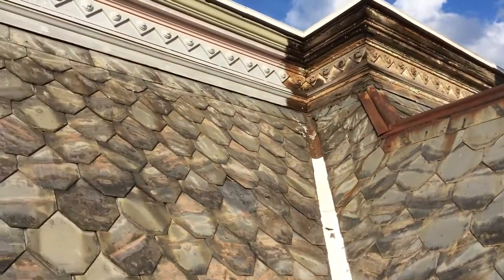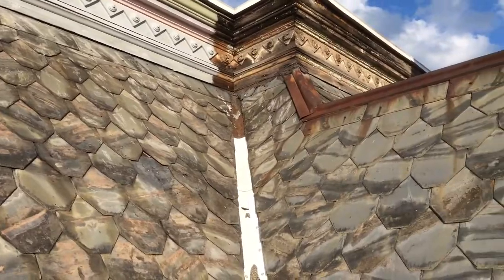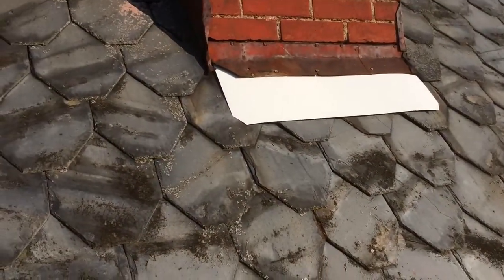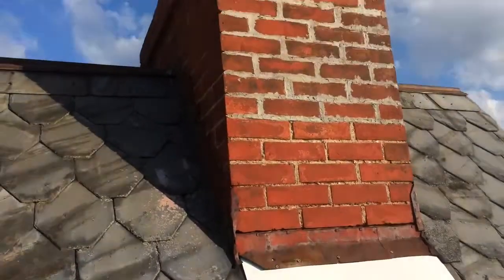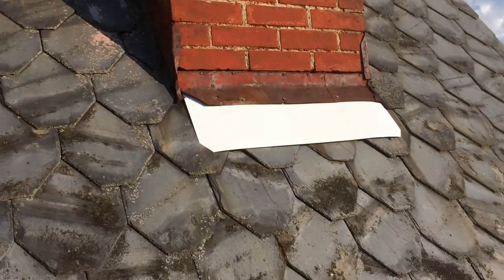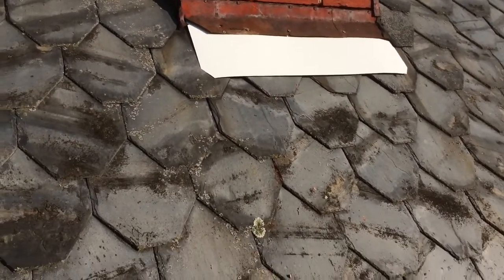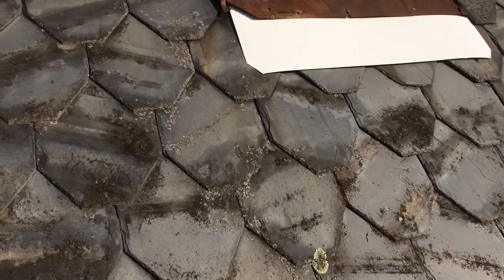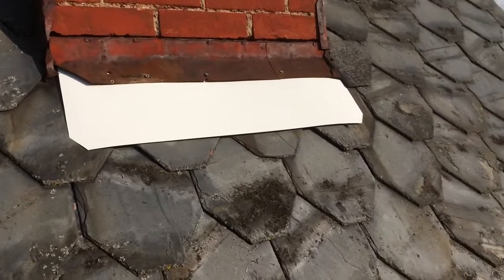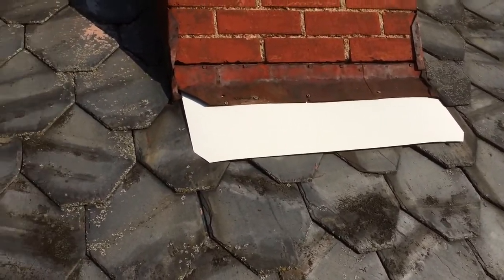And if there's any spots on the roof that are like that, I'll do the same thing, although I don't think there really is there. I also did a little flashing over here with aluminum where the chimney comes down. You can see how beautiful these chimneys are. It comes down where I hit the roof. One of the slates was loose there. Secured that a little bit better with one of the screws going in, and then overlapped them because some had fallen out of there. So we should have a good overlap now. No water should get in there.